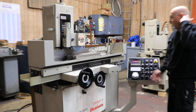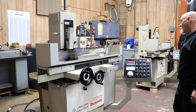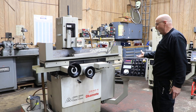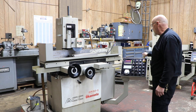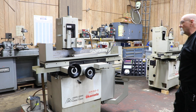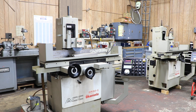So you can start off feeding, say, five tenths each down feed, and at the end — you pick at what point, say two tenths away from final size — you can switch to 50 millionths down feed. That's nice for some people; other people just want to go quickly. That's pretty much it. This is a nice machine — this is the original factory paint. That's the Okamoto 618DX, 3-axis automatic. Thank you.